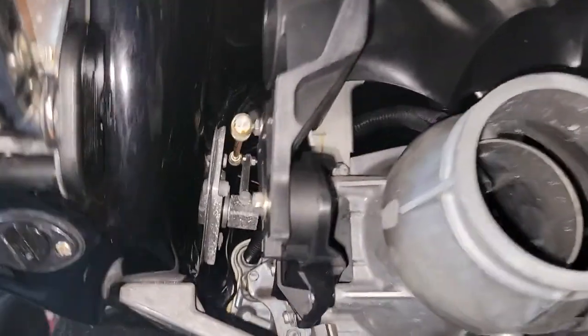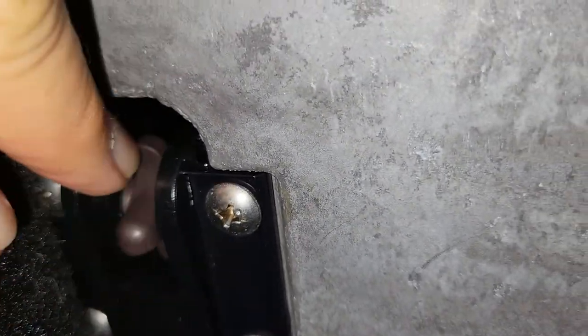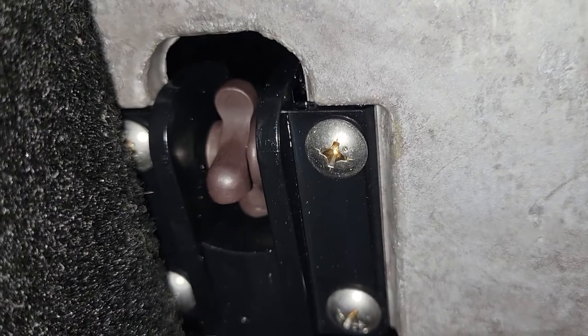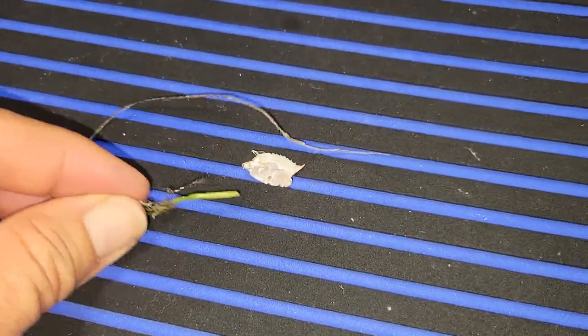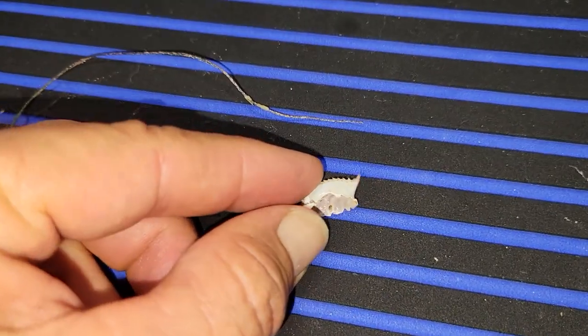Left side of the pump, up underneath — you ain't even got to go far. There's a little paddle wheel right there. That's all it does; its only function is to turn when the water flows over it. See if there's something up in there. In my case it was some seaweed, but that was not doing it.